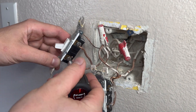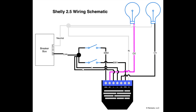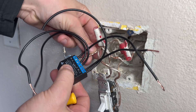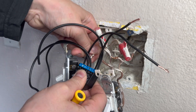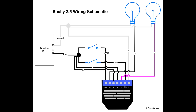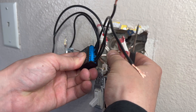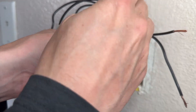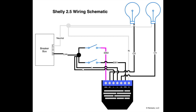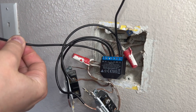As you can probably tell, I struggled a little bit with this one. Let's start by connecting the output that goes to the light bulb from the switch on the left to the 02 port on the Shelly. Next, we'll connect the output from the other switch to the 01 port on the Shelly. Next, we can connect the switch wire from the relay to the switch — we will connect it to the same screw that was used by the wire that is now connected to 02 on the relay.